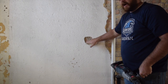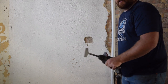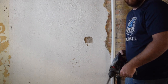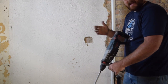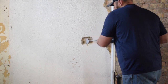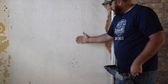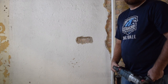So you can see that I've just barely opened that up to where you can see the brick — I haven't chipped the brick. That's why I think these tools are really awesome, because a lot of people say you need to use the chisel and the hammer, but you don't need to do that. You can use a good tool and get the same result without damaging the brick. Now that we have that brick exposed, try to keep the tool running as smooth as we can against it. Going at a nice diagonal — in order to not hit straight on where the brick meets up or down — is a nice way to try to avoid chipping and knocking stuff off the brick.